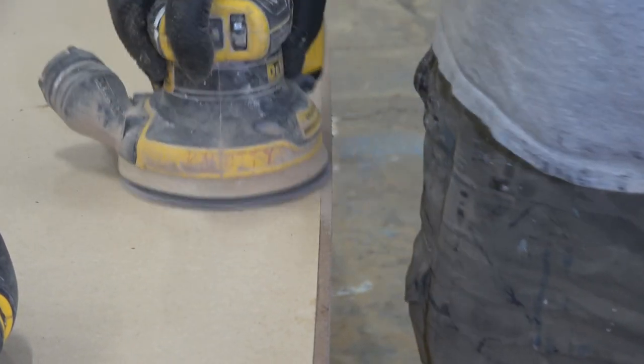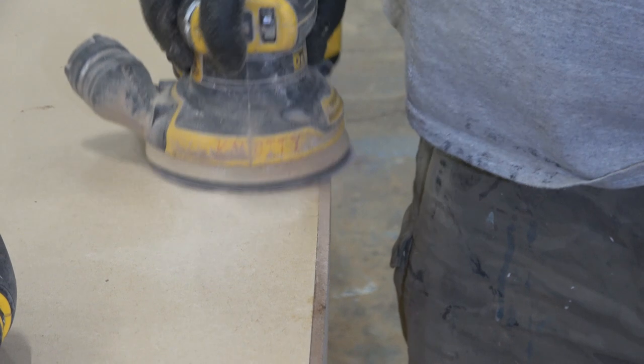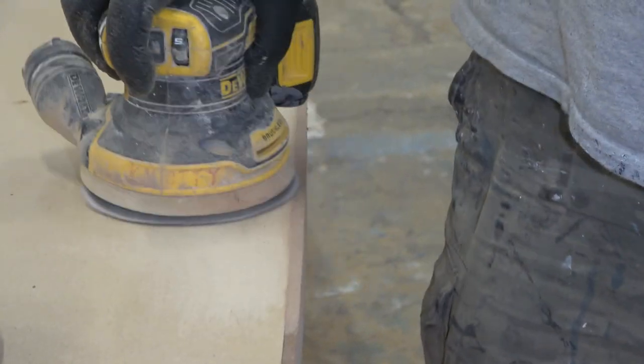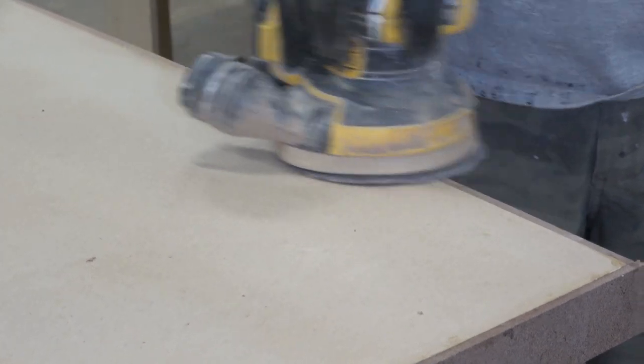Now that I've got all my pieces on, I've got my trusty orbital sander out again, and I'm going to sand this so everything's flush prior to putting on my bondo to hide the seam. So I want that to be really, really flush. I've got 220 grit and I'm just going to sand this all the way around the edges.